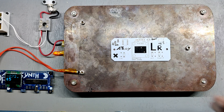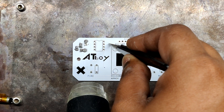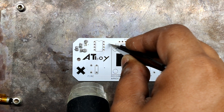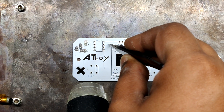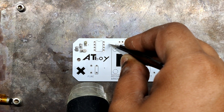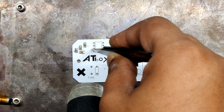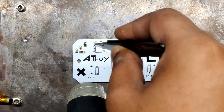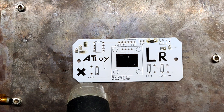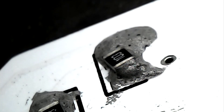Turn on the hot plate and wait a few minutes. After a few minutes the PCB starts heating up. As the temperature increases and hits the peak of 270 degrees Celsius, the solder paste melts completely. Here's a close-up shot.